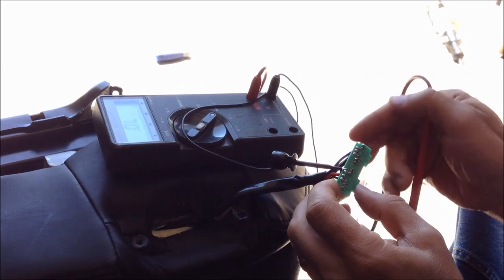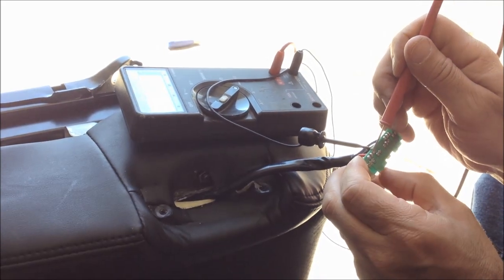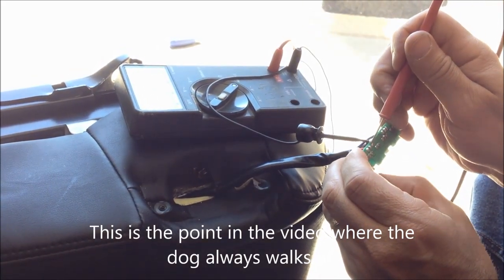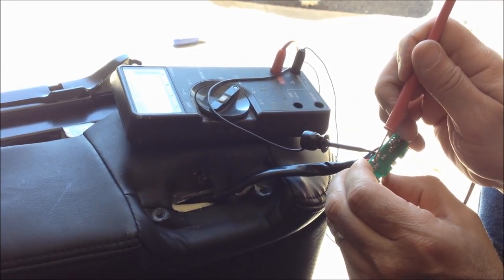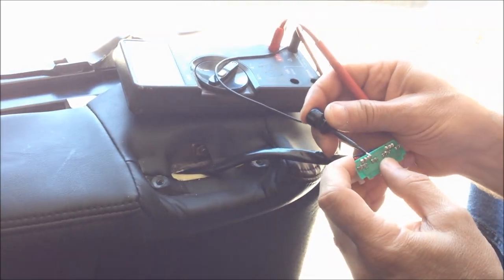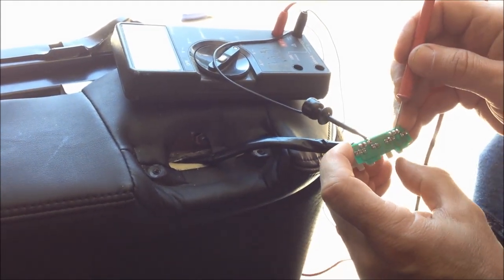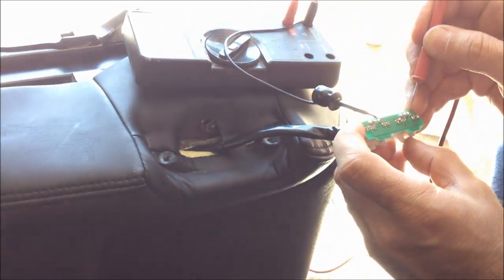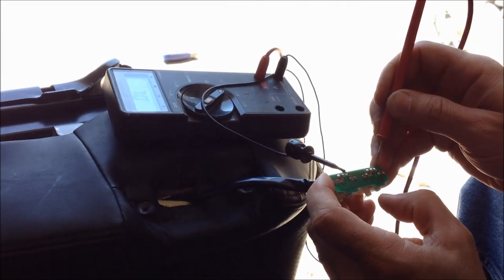With my thumb I'm going to control the other switches. I'm going to probe the first motor and operate the bottom switch — you can hear it make contact. I'm going to probe the next motor point and operate the top switch — that verifies that switch works. Keeping on the plus wire, I probe the white wire and operate the top switch, then probe the blue wire and operate the bottom switch. Now I know my switch is working and it's ready for reassembly.